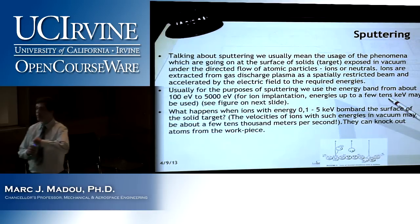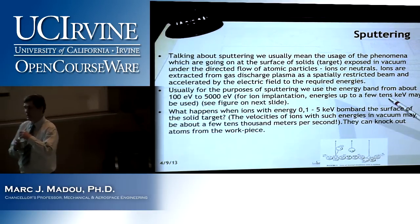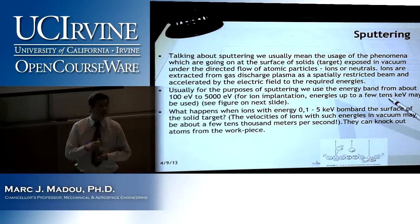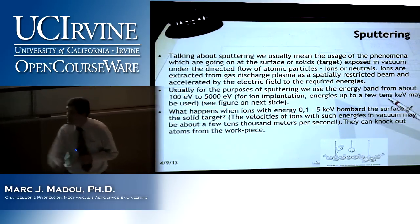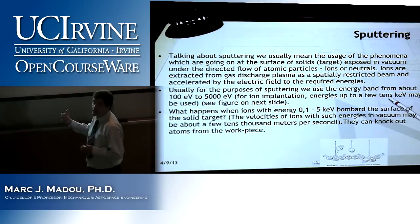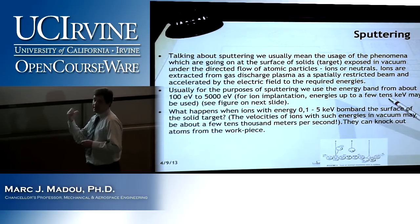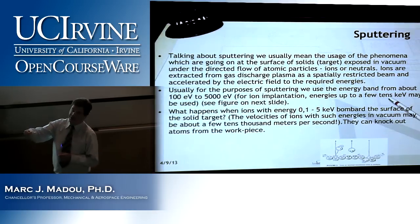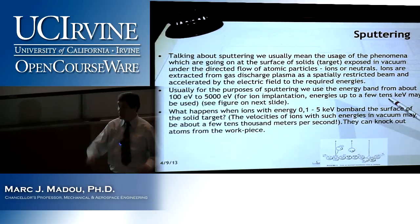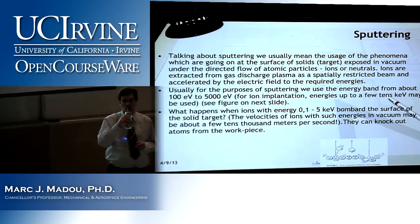Are you continuously generating those, like, that original free electron from that filament? You're continuously heating. Not from that. You missed that, eh? So that's an important point. You only need to create it once. Because what then happens, when that argon positive hits the cathode, it will knock off electrons. Oh, okay. So the argon hitting the cathode generates new electrons. But it's that first electron that you need to create.